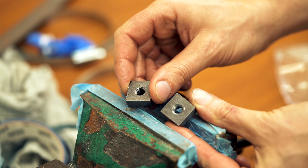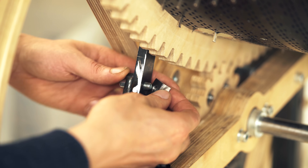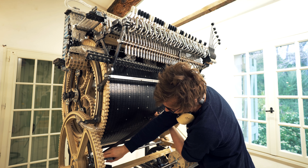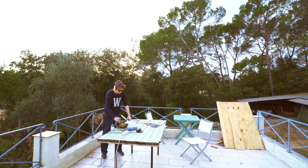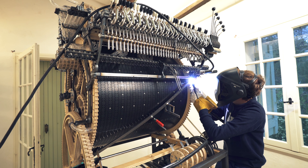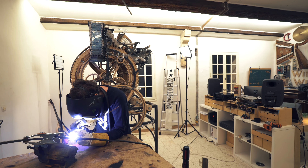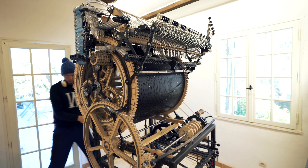People are gonna think this is CGI! So here's what I love about welding: I could screw these square tapped blocks in place exactly where they need to be and tighten down the bolts securely, then figure out the angle for my diagonal bracing, because the weld is just going to fill up any gap — so I don't even have to be super precise with these angles. Here you can see me using two strong magnets to hold the bar in place while tack welding it. I was careful to tack weld on several different spots so it wouldn't distort from the heat. Then I could take the bar off the machine and weld it properly on the table, letting the weld cancel out any inaccuracies in the cut angles. This results in a really precise piece with threads exactly where I need them, despite the fact that it's all manually mocked up.